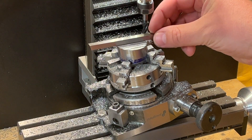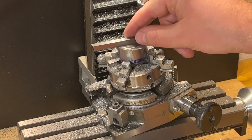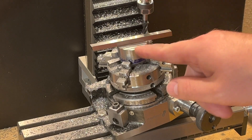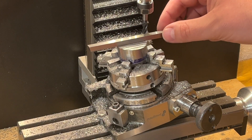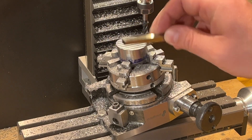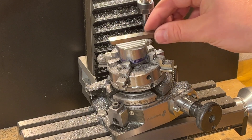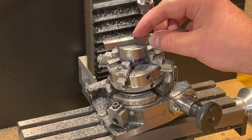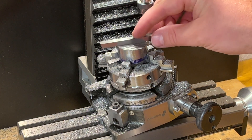The cutter should be located like this, with this side of the cutter exactly in the middle of the tool. That means the slot for the cutter will be on that side. I will also cut here to make screw holes from this side to hold the cutter. I need six millimeters from the center — that will be the side of the tool that holds the cutter. On this side I could have a slightly bigger slot, but not there. I need to measure it as accurately as possible; if the cutter shifts just a little bit it's not a huge issue, but better to be accurate.